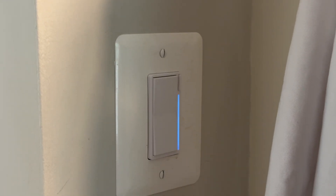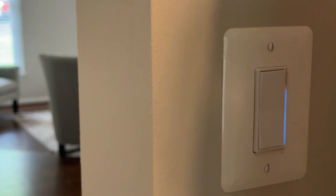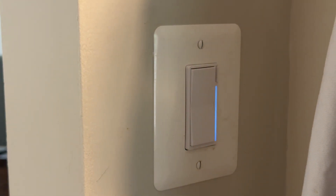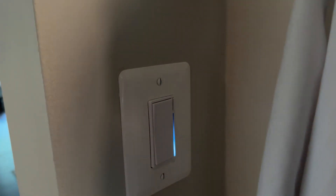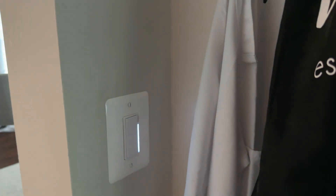In the kitchen, we have our first Inovelli switch, and this is the white series switch that indicates that it's Matter over Thread. I did not want to put this switch in here — this is where I wanted to put that other Eve dimmer switch, but I don't have a neutral wire in this box. I wanted continuity between the dining room and the kitchen, but with the way I have it now, one is touch sensitive and one is a rocker, which could confuse guests. The other major reason I didn't want the Inovelli switch here is its smart bulb mode feature. Smart bulb mode passes constant power through the switch to lighting fixtures, allowing smart bulbs to always have power so they can be turned on and off remotely. The Eve dimmer can't do this, so I feel like I'm wasting the potential of the Inovelli switch on non-smart bulbs here. I do use the favorites button to run our goodnight scene though, so that's nice.